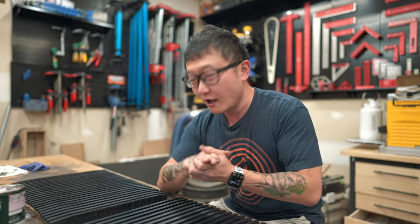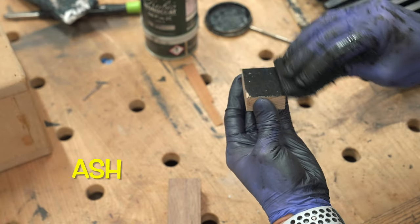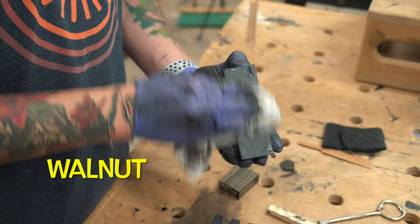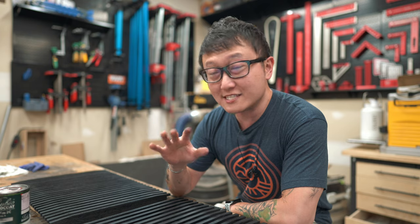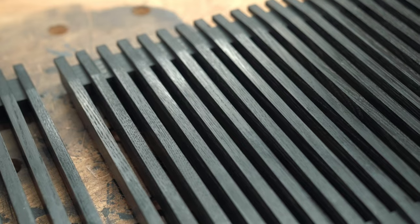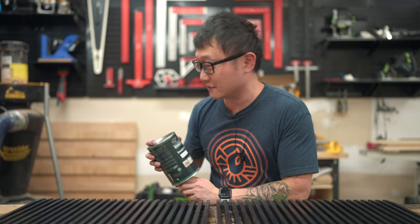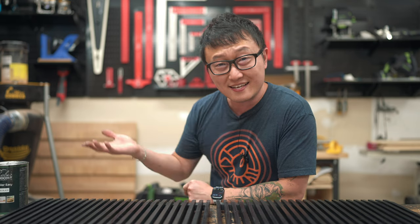That's pretty much all there is to it. One more thing: we will not be able to get this deep black color by only using the finish. It's going to darken the wood, especially in the grain, but it's definitely not enough — especially on lighter woods. Even if we started with something darker like walnut, we'd still get some of that brown peeking through. I've tried other methods to ebonize wood, and this is by far not the cheapest, but it's the simplest method that gave me the most consistent results while maintaining what I think is the most natural look and feel of the grain. I'm actually really curious if any of you have tried this product before, or if you've tried other methods — how do you think this compares? Let me know in the comments. I hope you enjoyed this video, and if you're interested to see how this media console turns out, be sure to subscribe and hit the bell notification so you know when that video goes live.